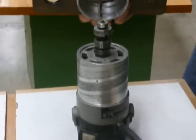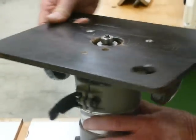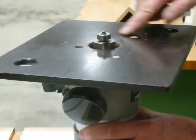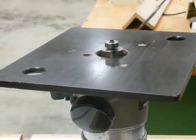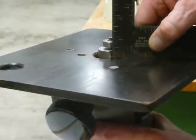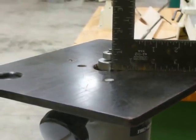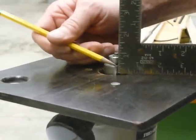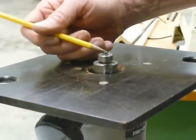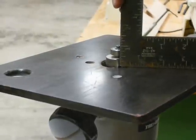Now I'm going to put the base back on and this is going to allow me to adjust my depth of cut. The router bit is protruding above the surface of the table and I'm going to use my steel square to adjust this for a three-eighths inch depth of cut. The carbide cutter is lined up with three-eighths of an inch. You don't want to measure to the ball bearing or to the top of the router bit — you want to measure to the top of the carbide cutter, three-eighths of an inch.